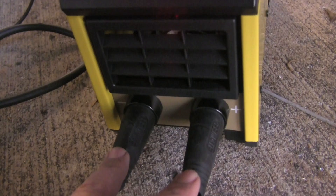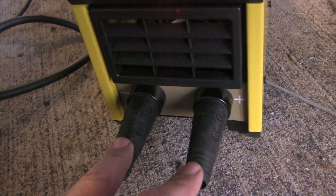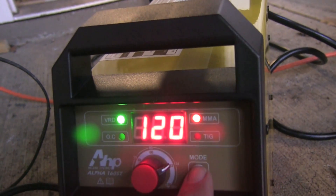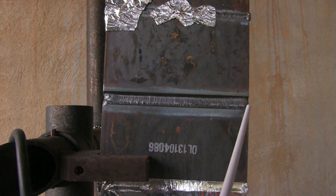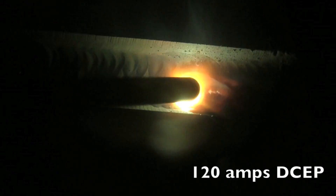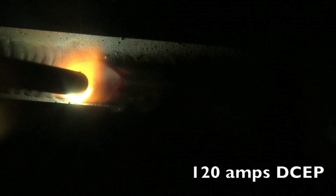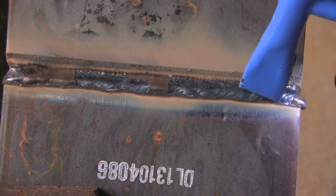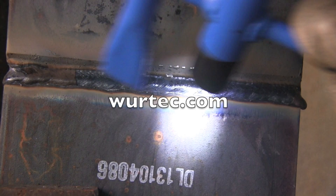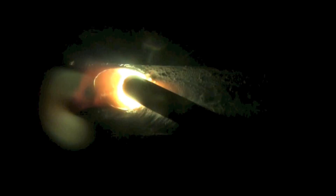We're going to go to stick welding now — 1/8 inch, 3.2 millimeter 7018. All I've got to do is swap these leads so that I've got electrode positive, then push the button to change from TIG to MMA. We don't talk about MMA much here in the States, but it stands for manual metal arc welding — what we call stick welding. This is a 7018 run at 120 amps, DC electrode positive, and I'm just trying to leave a little line at the bottom so I can have a straight line to follow for the cover pass. I showed this lighted chip and hammer in a previous video — it's listed at WurTech.com, but I'll keep you posted when they're available.